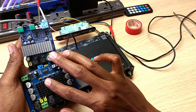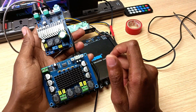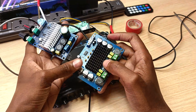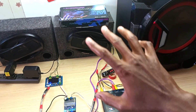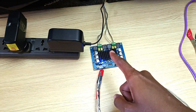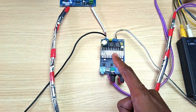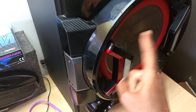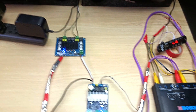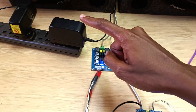Now I need to connect the audio output to my two amplifiers. This is a mid-range amplifier and this is a subwoofer amplifier — I have a review of both on my channel, so check the video description. This is the final music system setup. The mid-range amplifier is connected to two speakers, and the subwoofer amplifier board is connected to a 30 centimeter subwoofer speaker. Both are powered using a 19 volt laptop adapter, while the equalizer and MP3 player are powered by the 12 volt adapter.